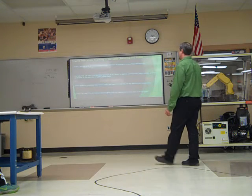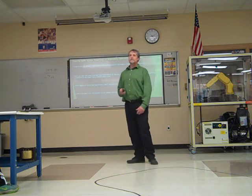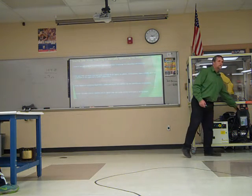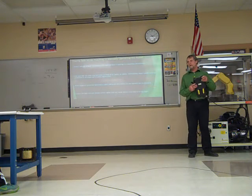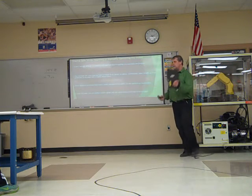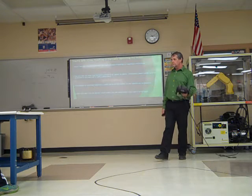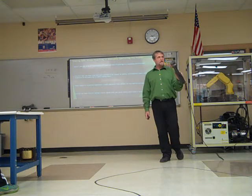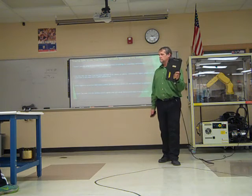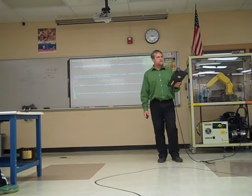Again, shouldn't be in there unless you're the one teaching it, and if you're the one teaching it, you should still be the only one in there. If you don't have this teach pendant in your hand, you have no business being in that envelope. Okay? You've got this in your hand, maybe there's four of you working in one cell. The only guy that's allowed in that cell is the guy holding this teach pendant. He's got the dead man switch. Okay? Nobody else is allowed in there.